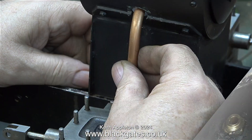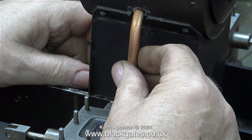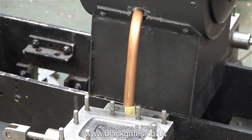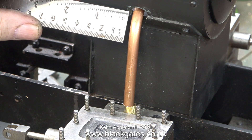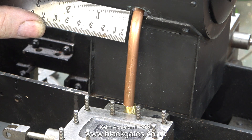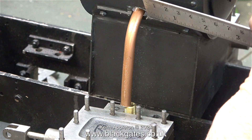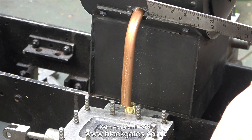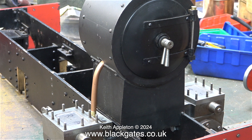Here's what I propose to do: first I'm going to make a flange that fits into the steam chest, another flange that fits on the pipe, and then a special fitting that goes through into the smoke box — I'll show how I do this in a future episode. The pipe will still need to be bent to fit in the smoke box, but nowhere near the stupid question mark shape. I'm also taking test measurements to confirm the hole in the centre is near enough for our purposes. Here's a better angle to show how the steam pipe will eventually look, and there will of course be an identical pipe on the other side.